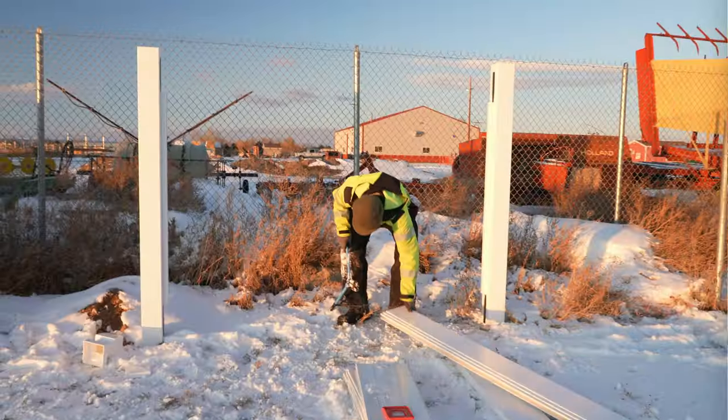Let's talk about these things. We've seen them before in other videos. These are rail locks. We have found them to be very beneficial for us because we live in the high wind area. Even though we have the notches on there, the rail crimps, wind can still blow that out. We've been amazed and astonished with the power that wind has. So therefore we've started installing these as well. And that just links everything together. It daisy chains everything so that nothing can be blown apart.